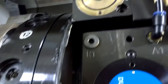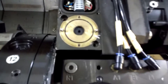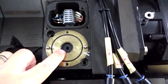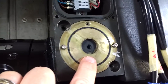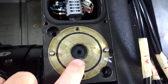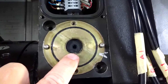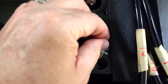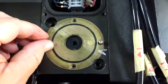you have to pull the covers off. This pin right here gets corrosion in there and it won't actuate properly, which has a sensor to tell it when it's home. So I temporarily stuck these screws in here to pull this out and you kind of have to tap this down gently and gently pry this out.